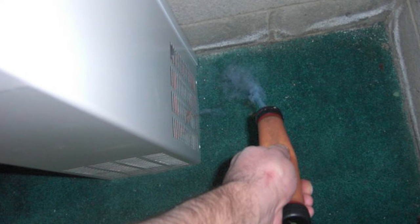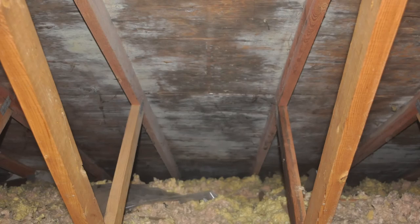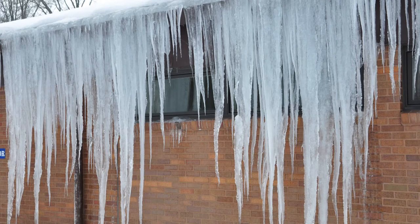When you have negative lower level basement pressure — also known as depressurization — you generally have the opposite on the upper floors, or positive upper floor pressure. The upper positive floor pressure could contribute to attic mold, heat loss, and/or winter ice dams.